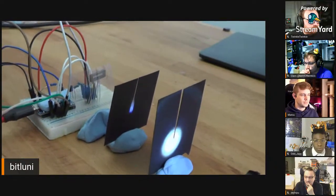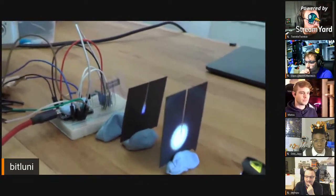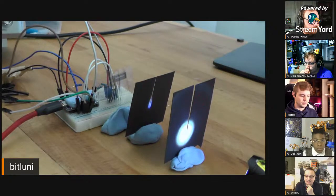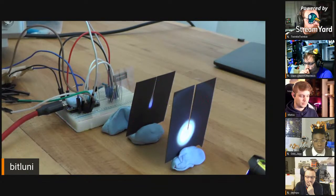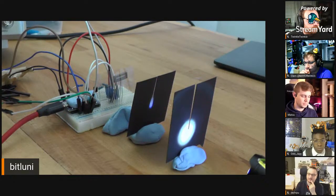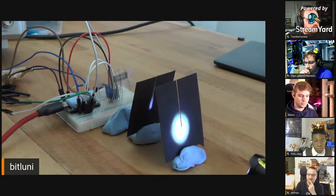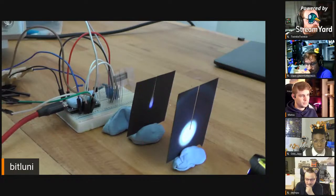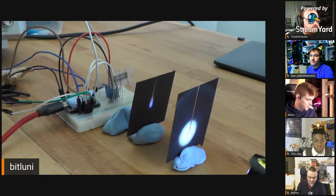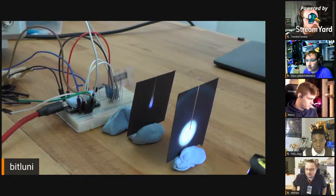But yeah, that's the current state that I'm working on. It's a little bit further than the last stream. And when I'm finished reading out the sensor, this one has a resolution of 1,500 pixels, so you can get 2 readings per nanometer of wavelength, more or less. Then I can take maybe a laser diode, so I can calibrate the wavelength with 2 different diodes where I know the actual wavelength, and maybe calibrate even the complete spectrum, normalize it with sunlight or with some kind of known calibration values. So that's the idea behind this whole thing.